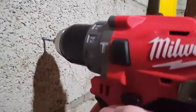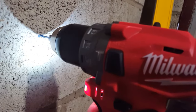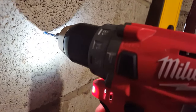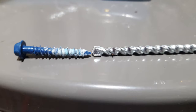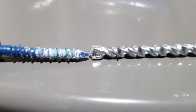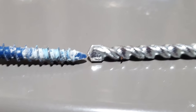If you're going to install a Tapcon concrete anchor, make sure you're using the correct size drill bit. You don't want to drill a hole that's too big so that there's not enough material for the threads and the screw to grab onto. This is the suggested 5/32" bit for the smaller 3/16" Tapcon, which you can see is obviously too large — it's not going to leave enough material.